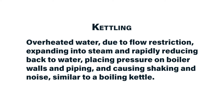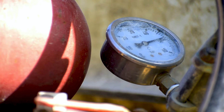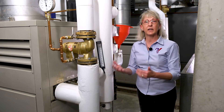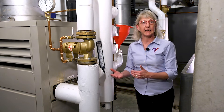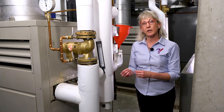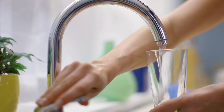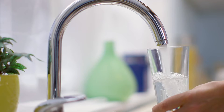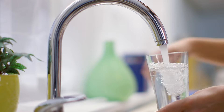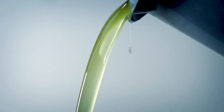What happens when the water molecules go from gas to liquid, it creates a shock wave that violently shakes the boiler as well as the piping connected to it and creates an environment where a leak is likely to happen sooner than later. So it's very important to periodically run a cleaning solution through the tubes to remove the scale. However, you need to be very careful because this is drinkable domestic hot water and you can't just use any harsh chemical to clean the tubes.